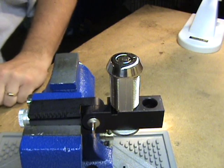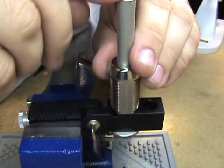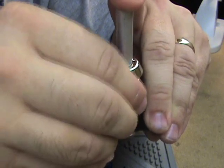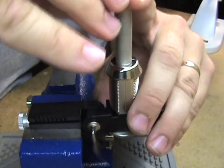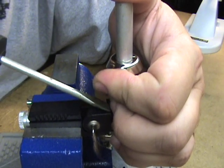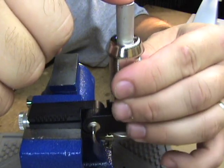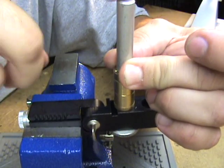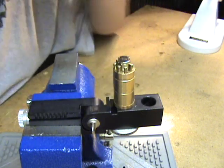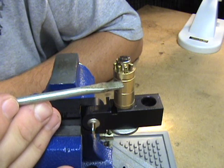We've got a little follower right here that's hollow in the end — you can make one of these yourself. Place that into the keyway, push down all the way and hold it tight, then work the threaded part up. Sometimes it takes a little screwdriver in here to help it. Just nice and easy, work it up, hold the follower down — don't let go — and pull the threaded part straight up. Let this up nice and slow because those pins will go flying everywhere. There we have it — there's the seven pins and you can see the shear line right there.